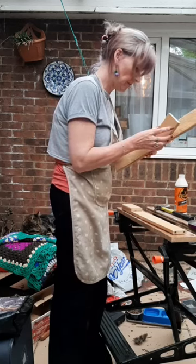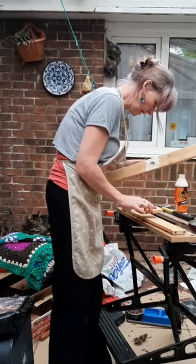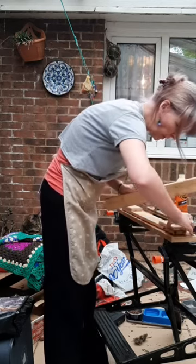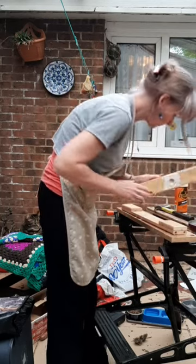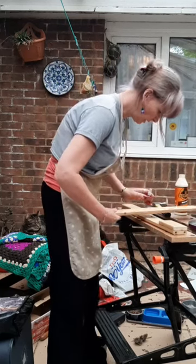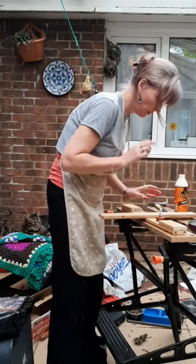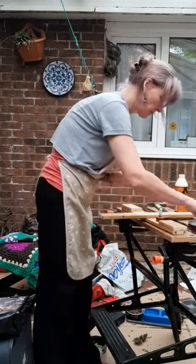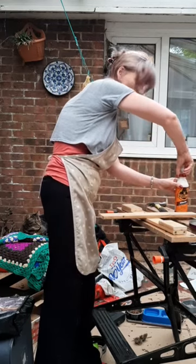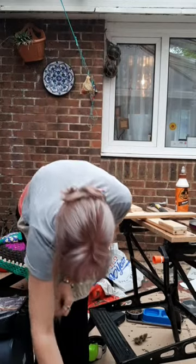So I'm also going to nail this in place. Alright. So I'll put them on there. Right? Nails on their own will not work. Glue on its own will not work. But glue and nails, right? Or in the case of the one with the hole in it, glue and a screw.